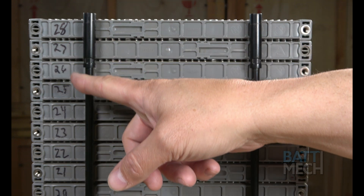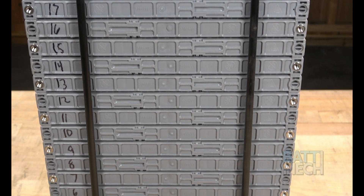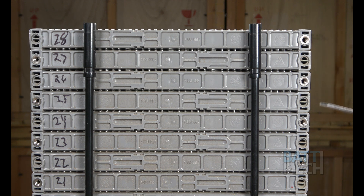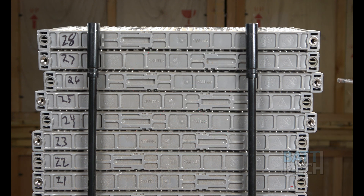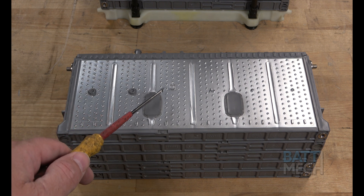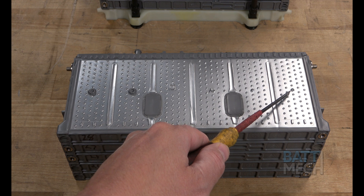Back to the other side of the module stack: if the numbering is out of order, you have the modules out of order. Notice at the top of the stack, on the left, the numbers are in order from 28 at the top all the way down to one at the bottom. To the right of the stack, the module stack starts with a threaded hole at the top — the pattern should be a threaded hole to a non-threaded hole down the side. The modules should be flush when stacked on top of each other. This is achieved by making sure the interlocking tabs on the modules are lined up where they connect to another module. If your modules are staggered, they are not stacked properly. Pay close attention not to make these mistakes.